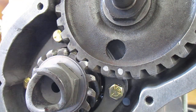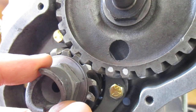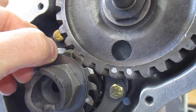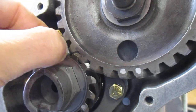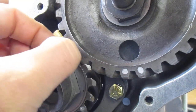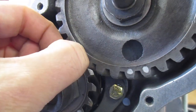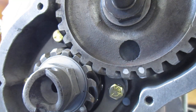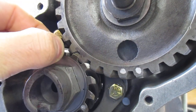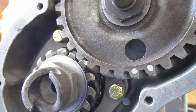I'm assuming I'm measuring it on the right face as well, because the crank rotates clockwise so I'm guessing the thrust face is on the front of these teeth on the cam gear, on the crank — sorry. So is doing it this way enough to tell me that this thing isn't going to blow up when I try to run it? This is one of the slightly tight places — you can see it just pinches it. But if I use my slightly mangled 0.3 thou shim and put that in there, it still rotates fine and even though it's tight there, there is still backlash.